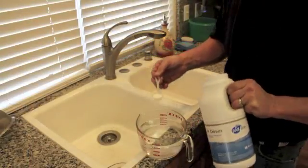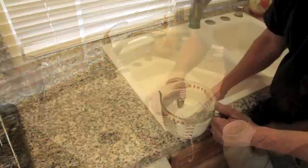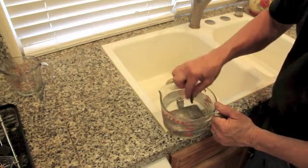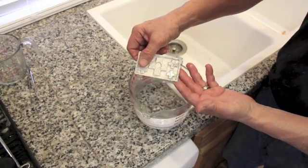When casting silver, the silver will come out a dark gray from oxidation. You need to pickle at this point. Pickling is an acidic wash — a very hot water bath. This will take all that oxidation off and bring out a nice clean piece of silver ready to polish.